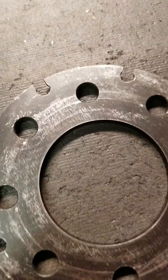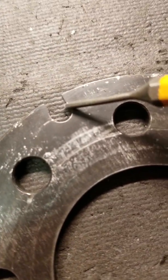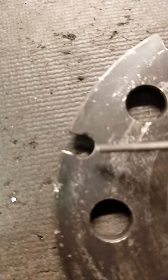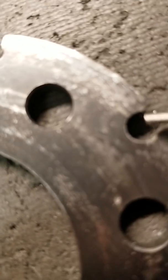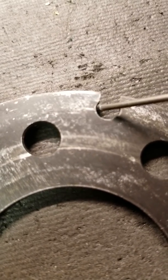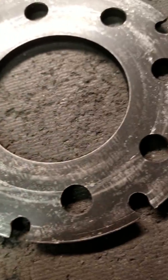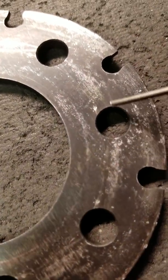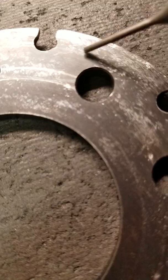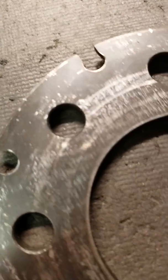Then we got to the fun part. Every one of the pockets is peened out on this edge in a drag mark. Every pocket has the same problem, and what that is caused by is a real issue in setting up the swage. It's hitting here and still up as the plate is moving, dragging across the plate on every single one. So every pocket has now been slightly damaged. I'm surprised their swage rod is working at all with that damage.